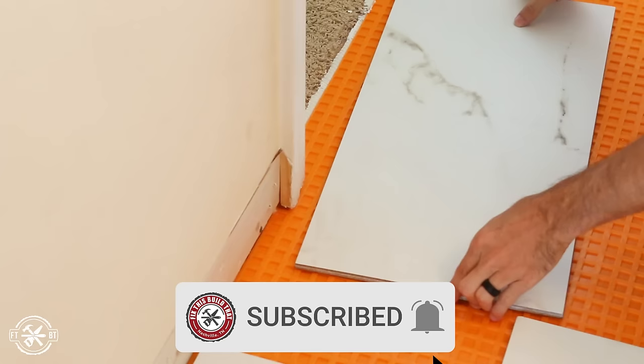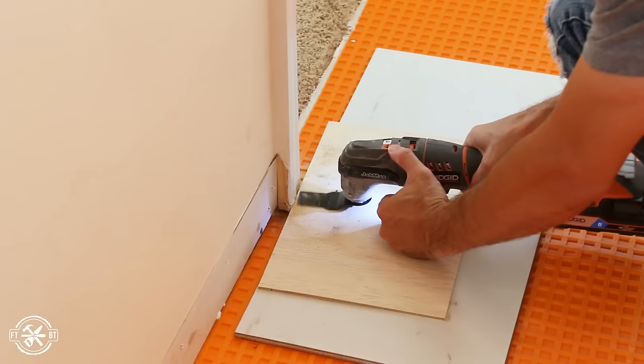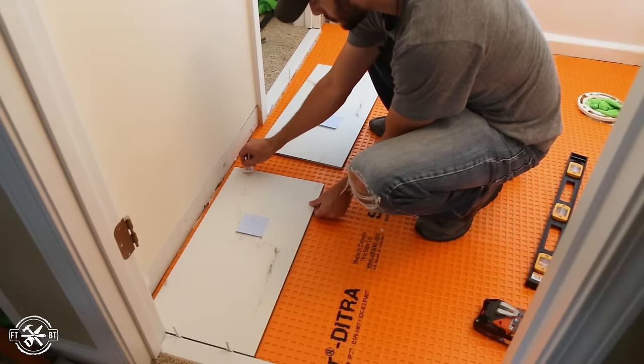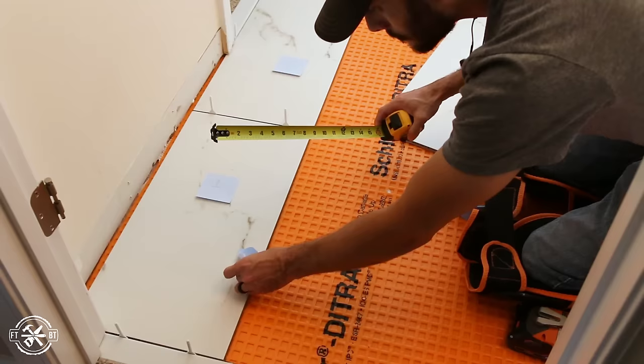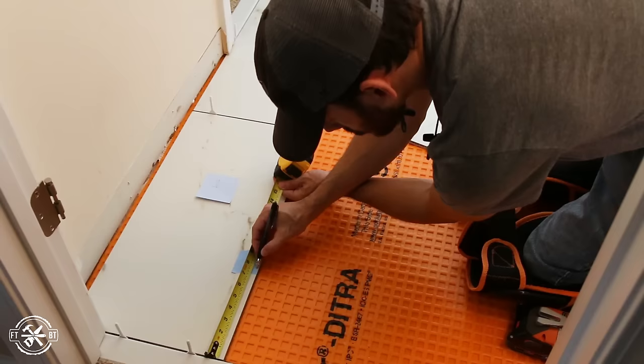If you're new here and you like what you're seeing so far, go ahead and subscribe and say hello down in the comments. The door jambs needed to be cut back a little for my thicker tile and mortar bed. I used a tile on a small spacer to represent the mortar and cut the jambs with my JobMax multi-tool. As a final piece of prep work, I slid the tiles under the door jamb and set them in place with spacers just like they'd be at install. Then I used painter's tape and marked 8 inches on the tile as a reference for my one-third overlap and figured out the cutoff piece size I'd need for the front of the door.